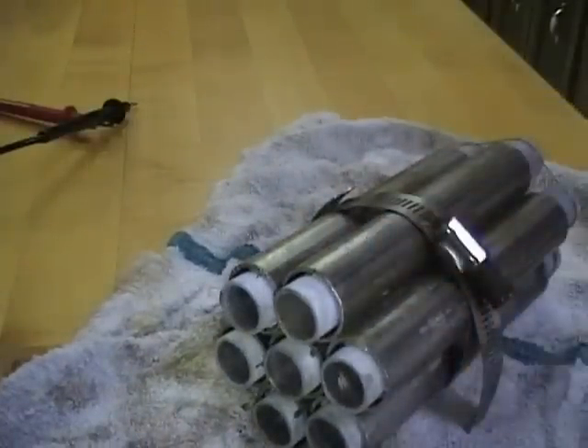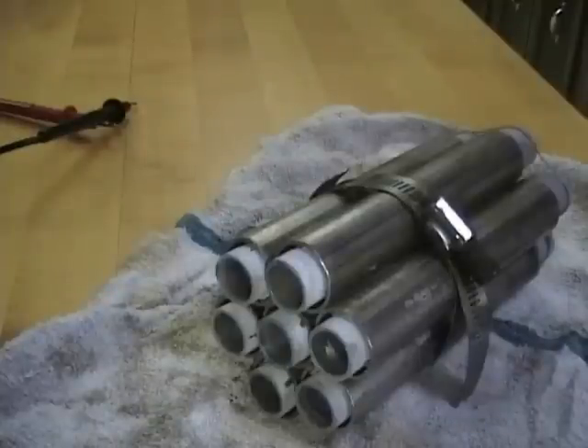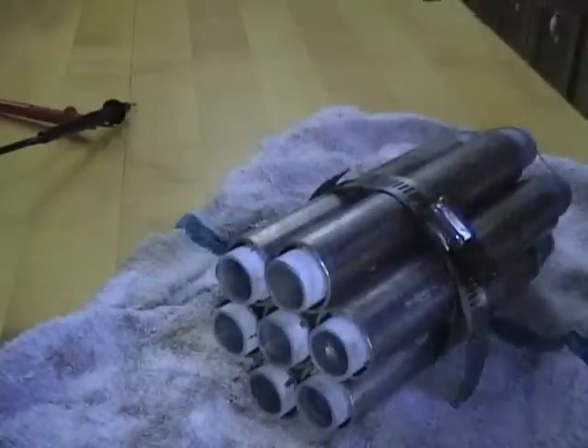The anodes are very shiny and very conductive. The cathodes are very non-conductive, with a calcium oxide coating that develops automatically. You can develop that coating in about a day to a day and a half, using maybe two amps at around 10 volts — about 30 watts worth of power. Running it for a couple hours, shutting it off, running for a couple hours, shutting it off. So about a day, day and a half, you'll have that coating.